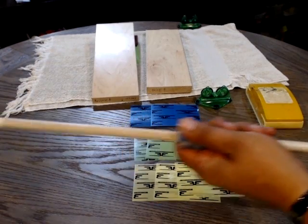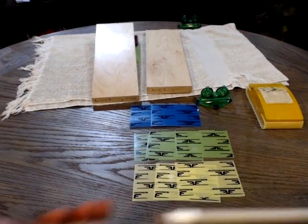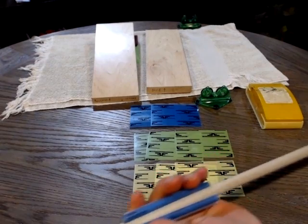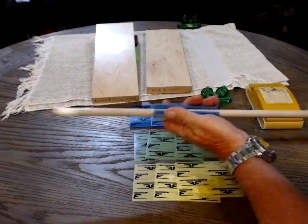Now squeeze the burnishing block lightly, as an aggressive grip will wear the film out more quickly. Let the film do the work. Get a full and complete coverage of the shaft, approximately 15 strokes while rotating the shaft. If your shaft is heavily contaminated, you may want to repeat step one with a new film before moving on to steps two and three.